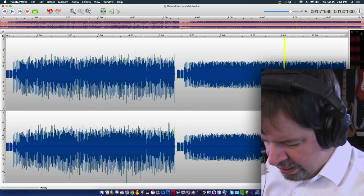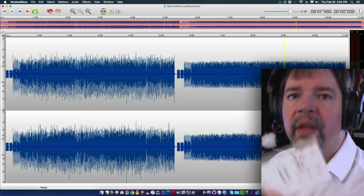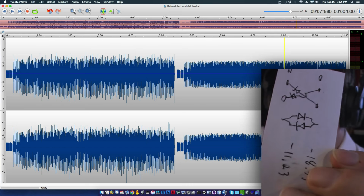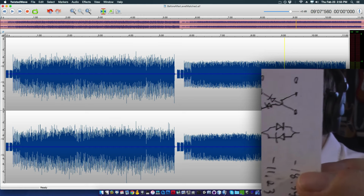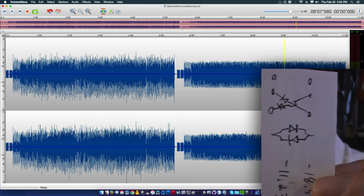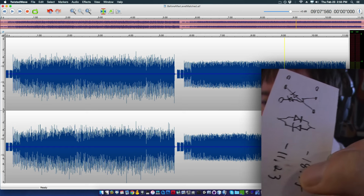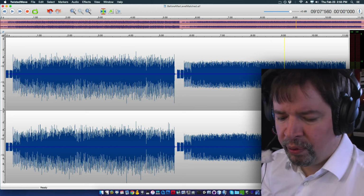This is not so unlike a stomp box, which is wired like this. If you have a diode-based distortion box, those are made in this way. You have the signal here, and then ground here. And the way diodes work, it takes a little bit to get them going. Diodes are a thing where if the signal is negative, one of the diodes will not connect and the other one will. And it's supposed to let signal through to ground when it's the right orientation. Whether it's minus or plus, a single diode will basically stop voltage in one direction and allow it in the other. But it doesn't instantly kick in when you're allowing the voltage.